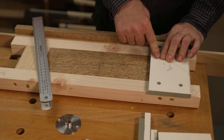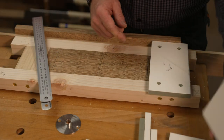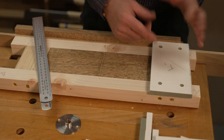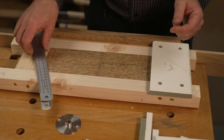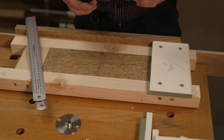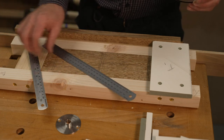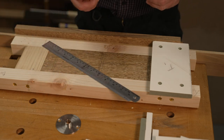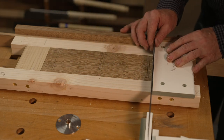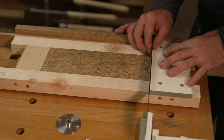The first one's the one that's going to take some time. I've numbered these so I know what order they've got to go in because I've got to work out the widths. So the first one becomes a stop point. I want a 2mm offset. What have you got that's 2mm that you could use? Well, actually, if you start measuring something like your rulers, they're 1mm thick. So we can put this in here and I can come up to where my joint line is, which is 10.